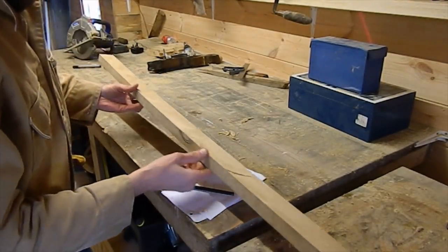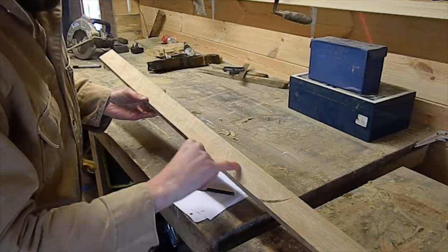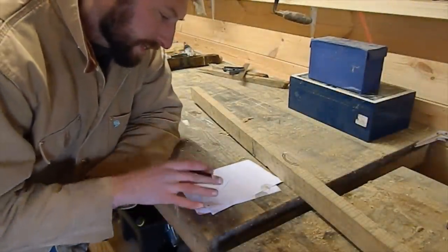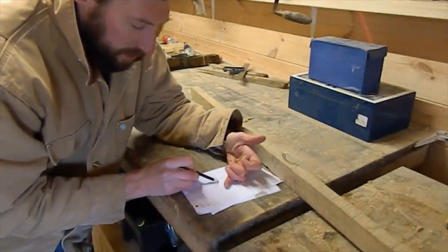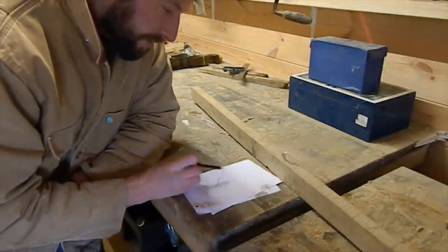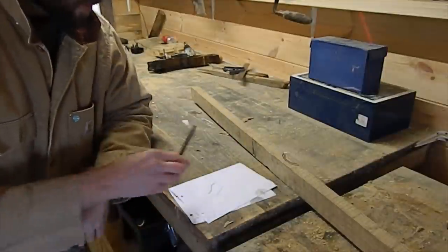This is the piece we've just cut out. We've just clipped the edge of one of the knots there, and there's a little bit of tightness in the grain rolling through. Where this rib is going forward, it's not a particularly tight turn. The ribs already put in have got a very tight curve — almost a double bend, like an S-bend — which puts a lot of strain on the wood. But where this rib is going up forward it's very much a simple V, without a great deal of twist, so I think we'll be okay.